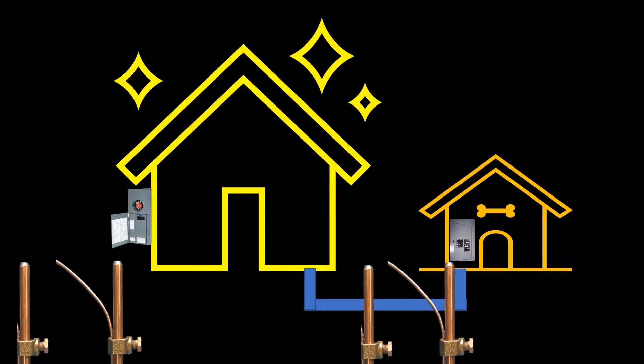But the question is: why did I have to drive two ground rods here if I have four wires coming from the building? I've run four wires from the building and I've separated my grounds and neutrals. There should be no danger of objectionable current because I've got my neutrals and my grounds separated. So let's answer the question — why?